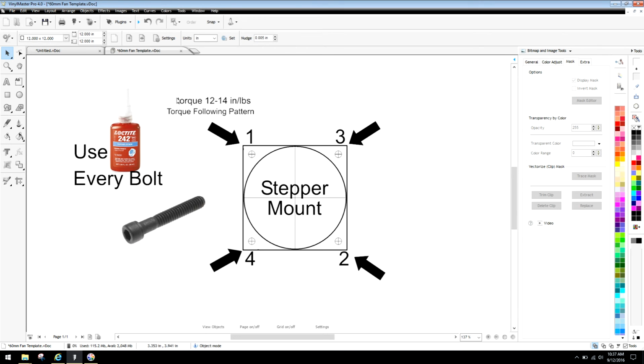So please do that. Document everything, date it, put down the torque, put down any adjustments you make. If you started with 12 to 14 inch-pounds and 2 weeks later you realize it's off a little bit, maybe it's down to 10, what do you want to do? You can analyze the situation. Should I just pull the bolt, re-Loctite it after I clean it again and do all that? You could definitely do that. Whatever you feel you want to do, I would definitely document. And whatever changes you make, let's say you decide to pull the bolts, re-Loctite them all, re-torque them down, and redate it.